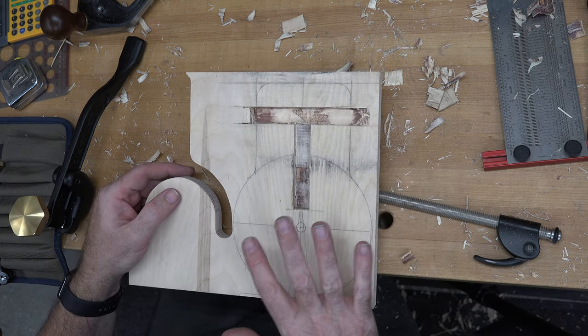Now that that piece has been cut and sanded, we can give it a little test fit to see how well it fits into place — that's pretty tight in there, which is a good thing. The next step, as long as you're happy with the way it's fitting, is to drill two holes here so the upright can glue to the gusset as well. We're going to drill one hole on this side and one on that side so our upright can be secured to our table.